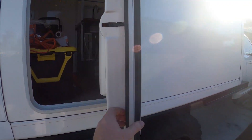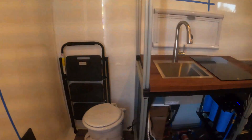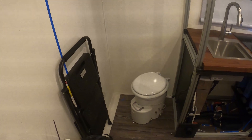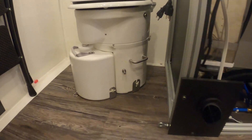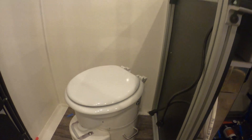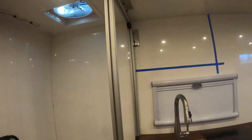I'm eventually going to get it ceramic coated black — stainless is pretty gaudy and screams for attention, and I'm trying to stay low-key. Finally got most of the water system done, took a lot longer than expected. The composting toilet is mounted — sorry for the flicker, the LED lights are wigging out. That's the Airhead composting toilet. I chose it over the Nature's Head mainly because it's a lot better for a wet bath, it's more sealed, I like the fan mechanism better, and you can dump the pee bottle without removing anything else.